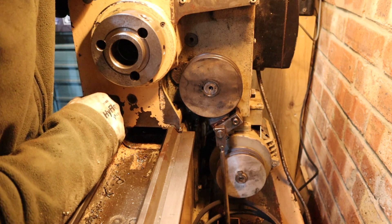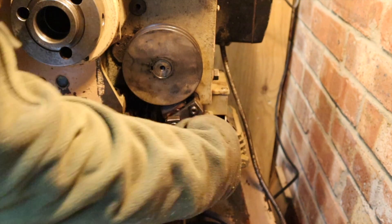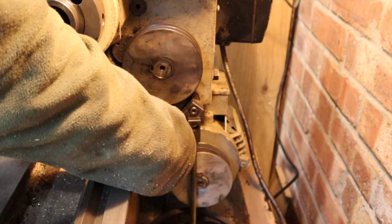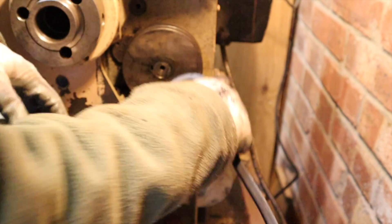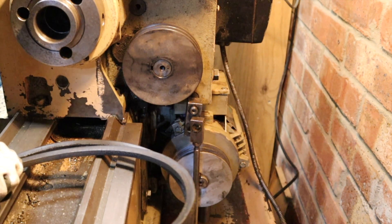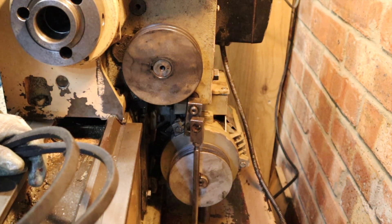Like a lot of stuff I tend to over-complicate things and this has been one of those times. It actually turns out there's a pin here with a C-clip on the back — with that C-clip removed you can just pull the bolt out. The brake pad came out of there as well, and with that removed I was able to slide the belts up and over. Got the old belts off. Now there'll be a bit of reassembly — it's basically a reverse of what I've done. I know I haven't captured a lot of this on camera, it's just been really awkward to get to, but I'll try to give you a better look on the refit.